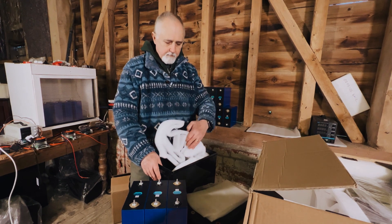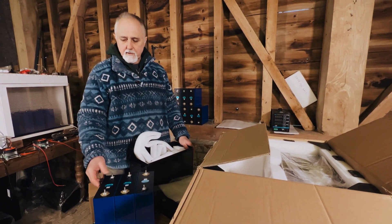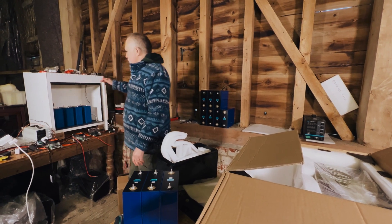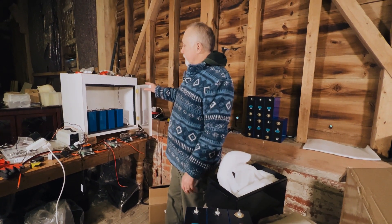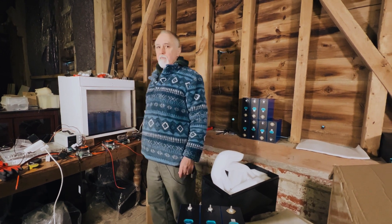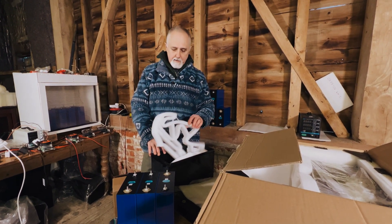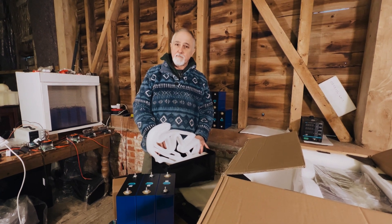Thanks for watching, folks. We'll get these down to our heated shed for top balancing, and once we've finished top balancing we'll put them into our heated booth — we have another set we're about to test there. The purpose is to bring the cells up to 20–25 degrees centigrade, because to be fair on the supplier it's no use testing at too low a temperature and getting a less than optimal result. We need to get them to around 20–25 degrees, and they seem happy with that. Hopefully see you when we get the capacity test results out.